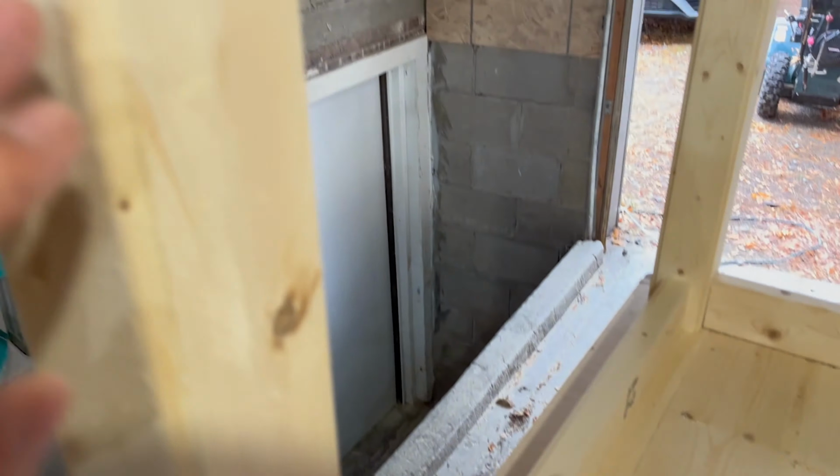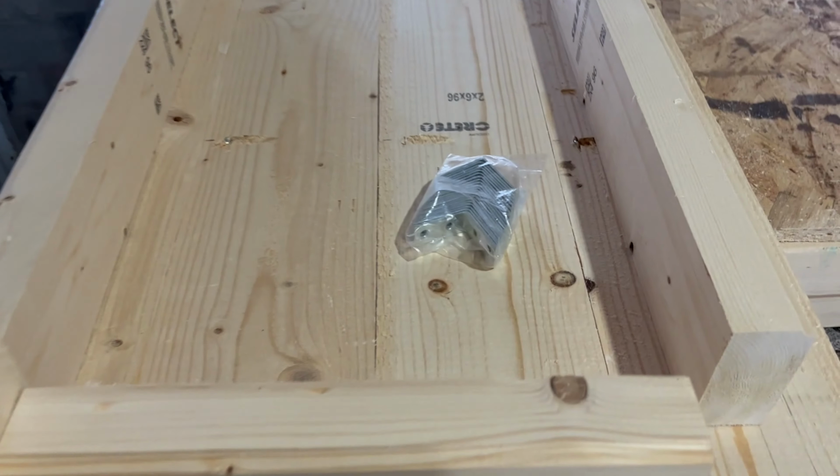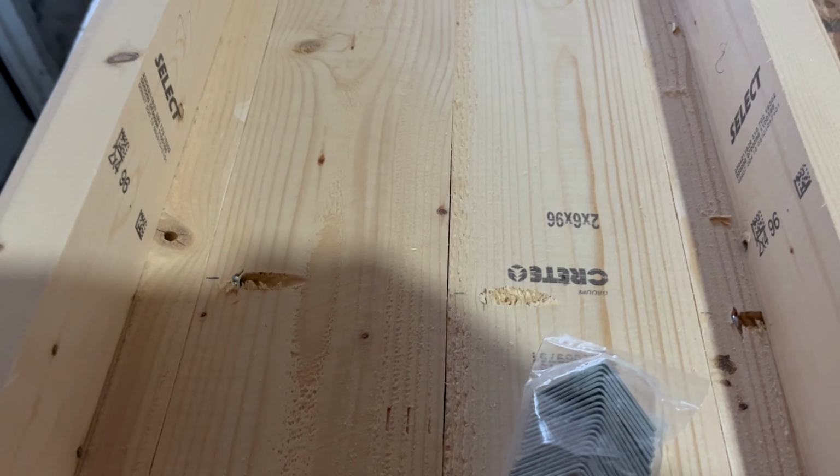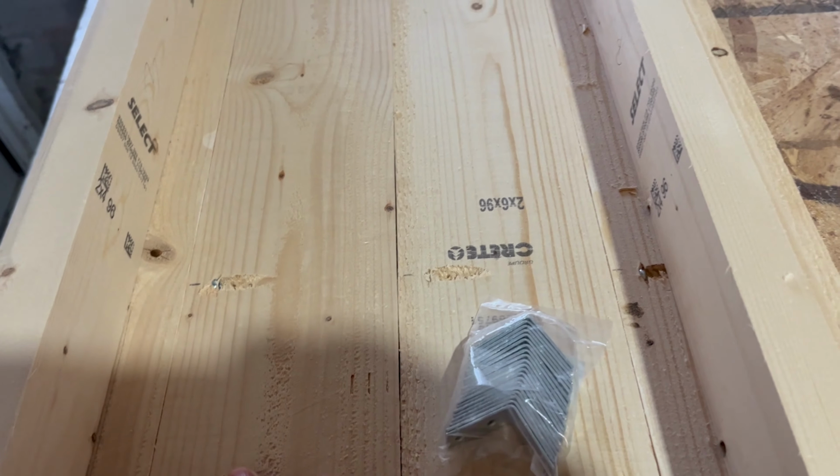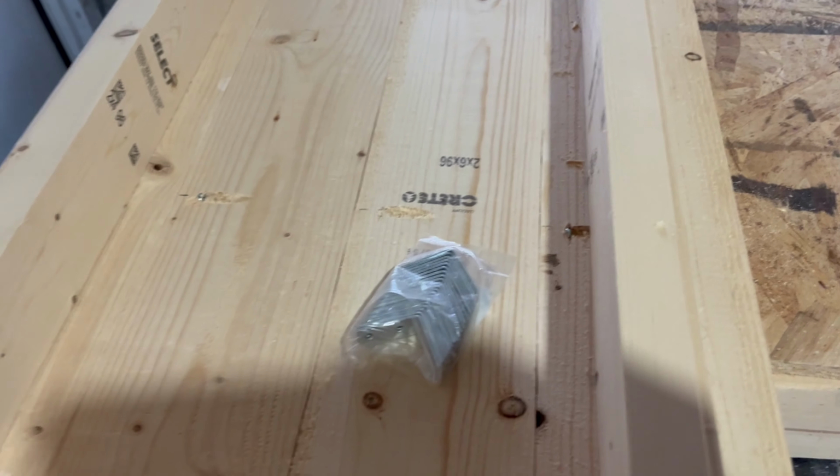Inset the legs, and then I get the shelf on here. I already got the lumber to do the bottom shelf, so we'll do the same as the top. On the bottom shelf, I'll just go ahead and pocket hole these and glue them together and then sand them on the outside. It should look pretty good.